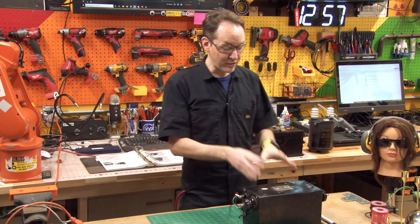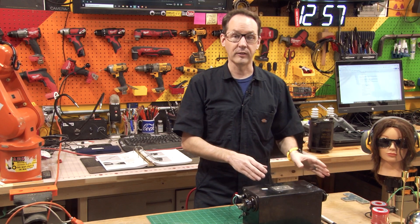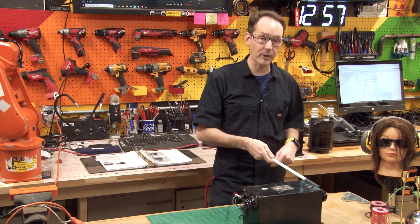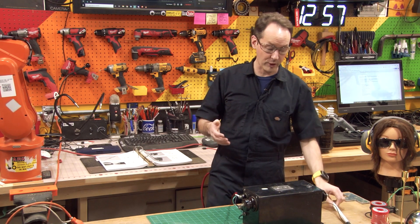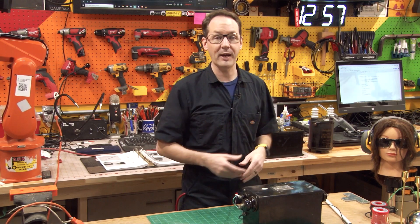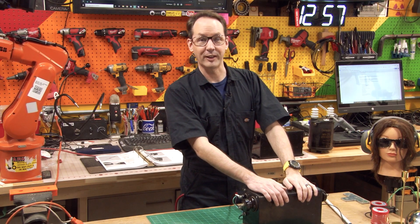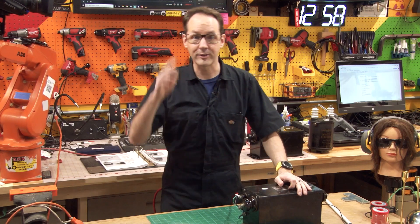When these transformers fail, usually one side or the other is going to fail. So when you do your test, you'll get a spark on one side but not the other. If you're buying a transformer or have one that's questionable, this is how you test it. And now you know — if one side is bad, it makes a great doorstop because they're a nightmare to fix. But now you know the basics of how to test your neon sign transformer. Thank you for hanging out today and for learning something cool. I'm Chris Bowden, and as always, we'll see you next time.